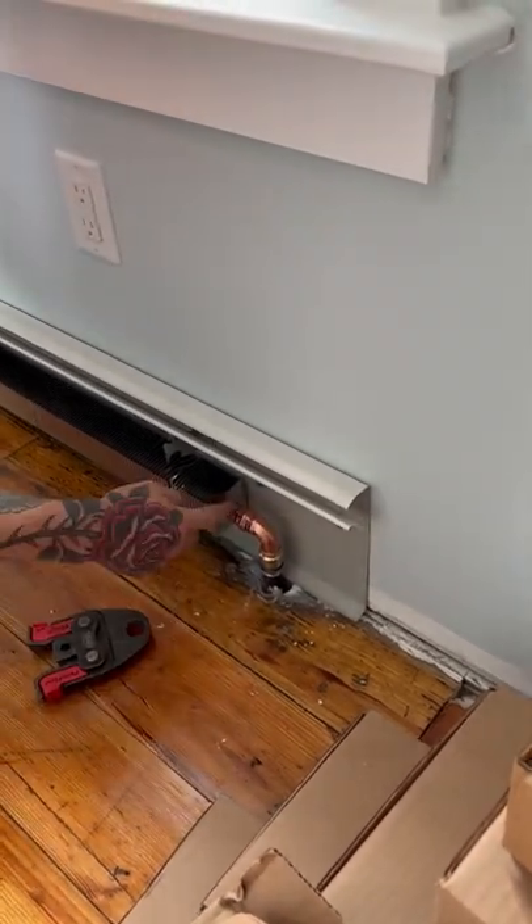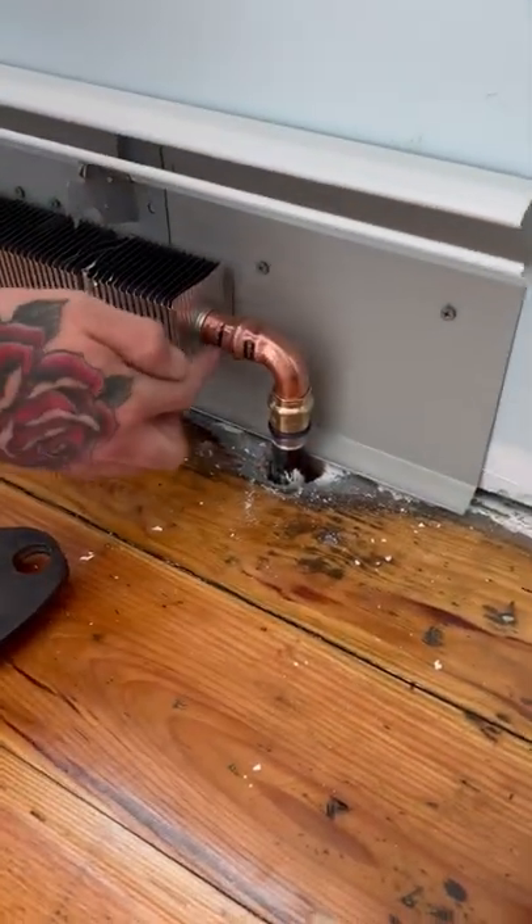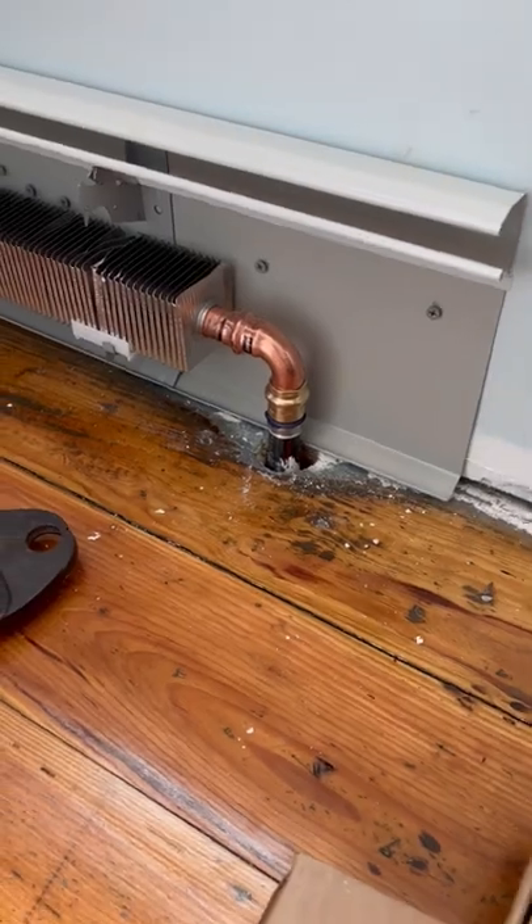I love having that witness mark there — that full insertion — because I was pulled off a little bit, so I actually shoved it over before I made that press. Wouldn't have known if I didn't have my mark on it.